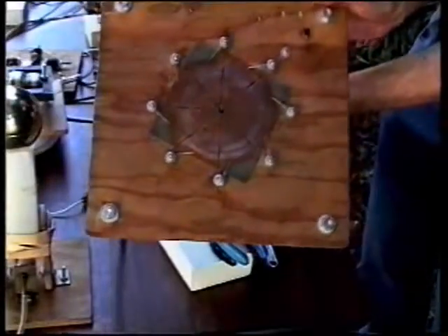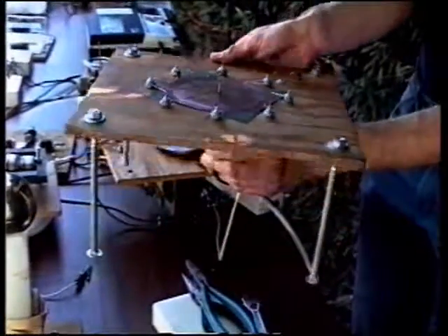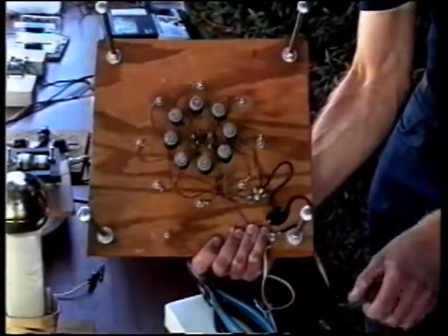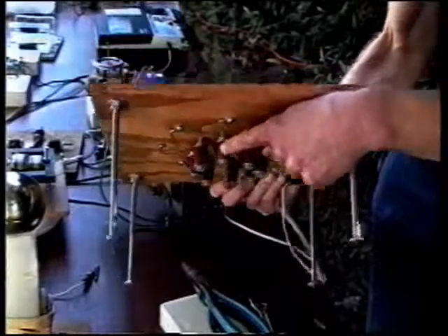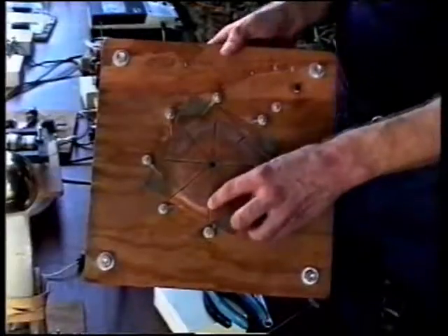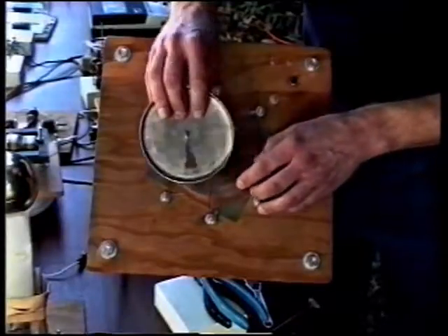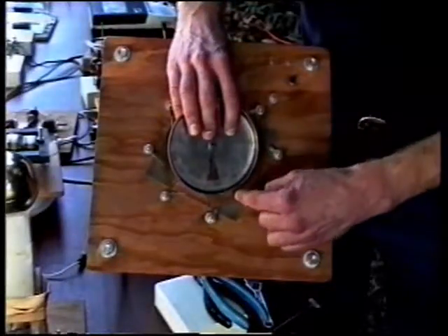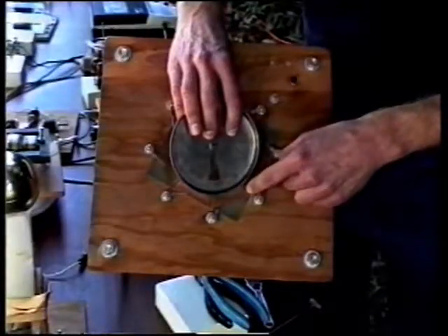Let me turn this up so you can see it more clearly. Each of those copper triangles is electrically connected to a single electromagnet — you can see these electromagnets down below. If we trace the position of one of these electromagnets, you'll see my scheme. For example, this one right here is located right there on top. When the rim of the lid touches down onto that copper triangle — the copper triangle that feeds that electromagnet — its electromagnet comes on and pulls on the lid, pulling it straight down.